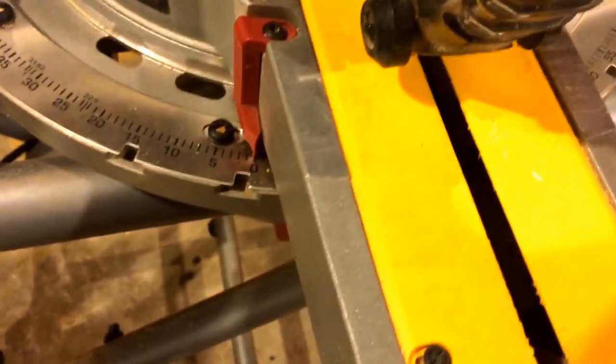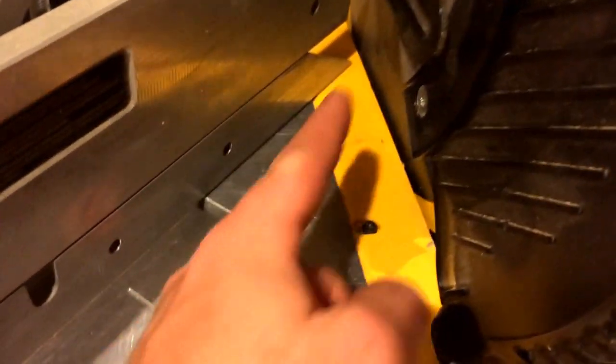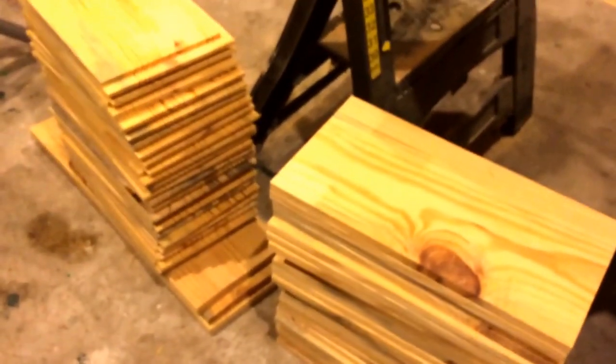Set it in against this side — it's tight there and it's tight there. When I started off there was a crack on the opposite side, a crack back in that corner. So with the screws loose and locked on zero, just tap it real gentle until it's lined up smooth, then torque your screws back down. You can even check it — I had it set on zero, then came through with a speed square. It's got a 45, so I turned my saw to 45 and checked that 45 miter. Then I came around the other side and checked 135. You can check it off a few different things — if you have fancier squares you can check 60 or 30. Got it all squared up. The funny thing is I had a whole bunch of stock cut for beekeeping boxes, cut just a little bit big. I ended up having to trim every single one — taking off just a little sliver where at the front the blade took nothing off, and at the back it took off just a little shade. So it definitely was out of square. I proved it. I fixed it.